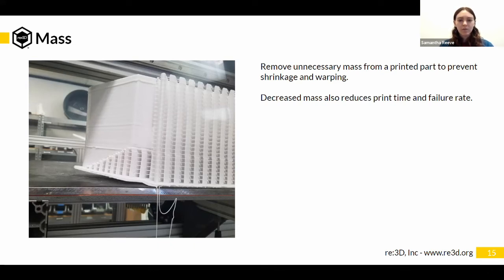People new to 3D printing often ask for completely solid parts. I'll either tell them no, or just slice at like 80% infill, which is practically solid — because you're not getting much strength once you get up to 45–50% infill. It's really a diminishing return to add any extra infill beyond that, and it's also more likely to harm your part because you're adding more mass as well as more print time. For a high-strength part, it's much better to just increase shell thickness.